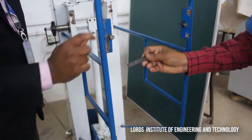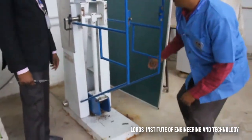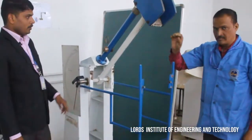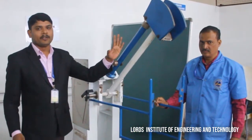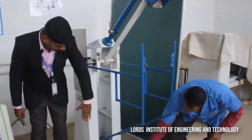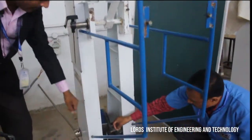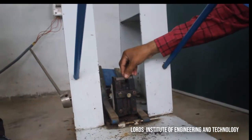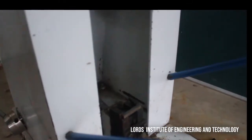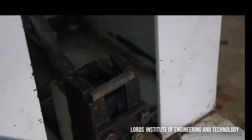The total length is 60 mm and at a distance of 30 mm we are making a V-notch whose depth is equal to 2 mm. We are placing this specimen so that the notch is placed in the reverse, opposite direction to the hammer. We are placing this notch in such a way that it is exactly coinciding with the striking part of the hammer. The striker will exactly strike the notch area, and because of striking the specimen will break up into two pieces.